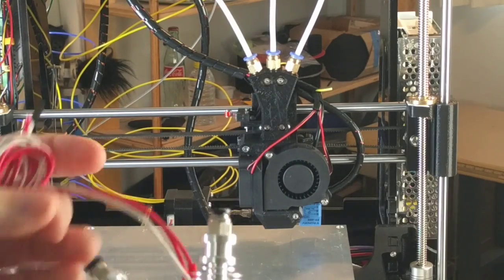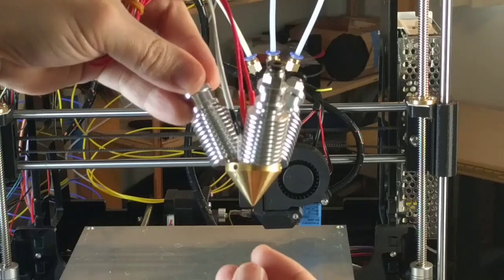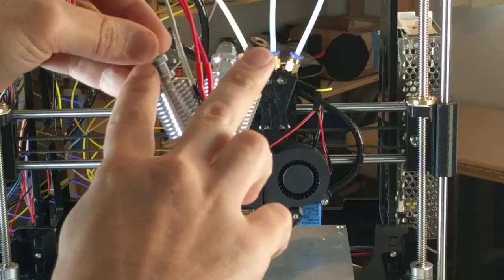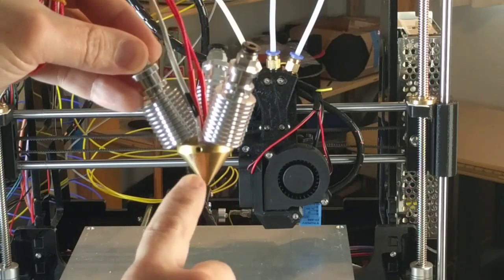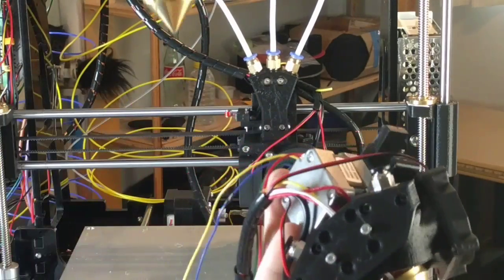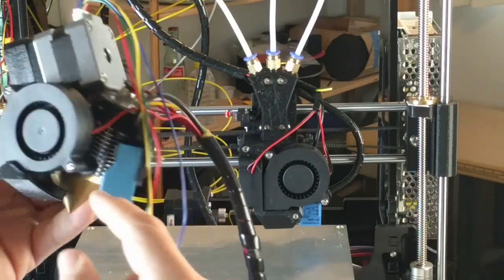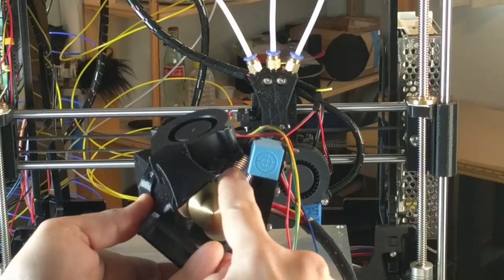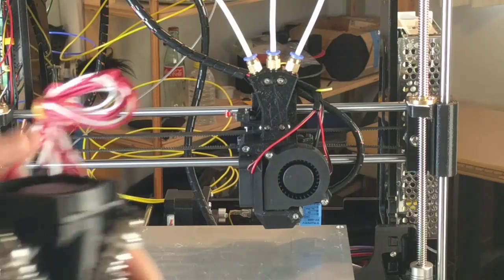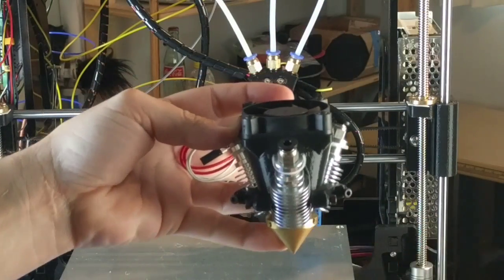This is a diamond head — it's a three-way splitter and a mixing chamber, so I can feed all three filaments at one time and it will mix the colors right there in the hot chamber. With my design the fan here catches air, blows it through, and exhausts inside. Almost all the designs I saw online have a fan mounted on top blowing air straight down past all three radiators, but I needed that top area for the direct drive motor.